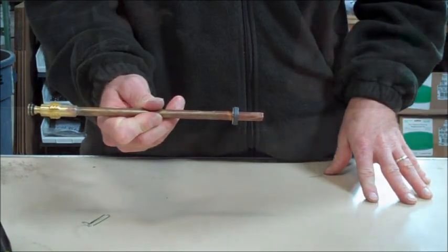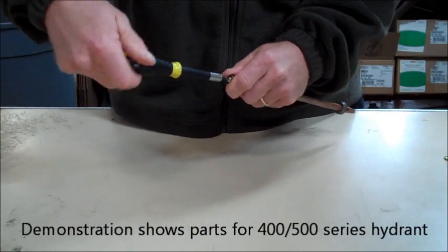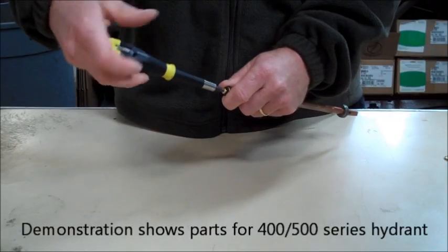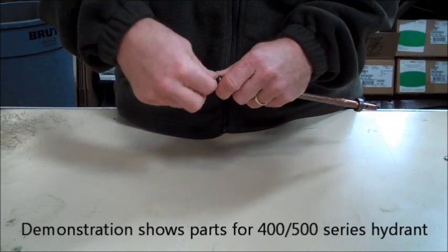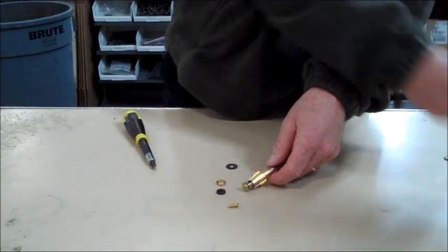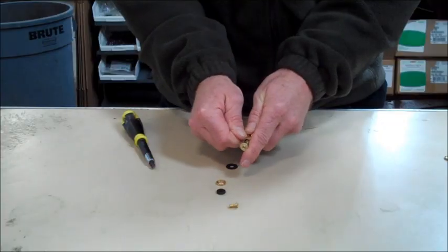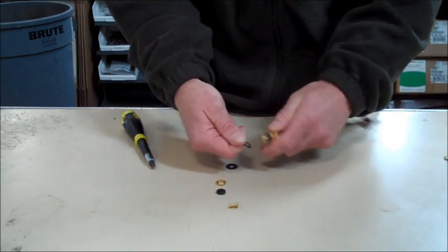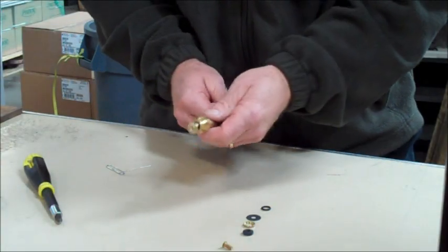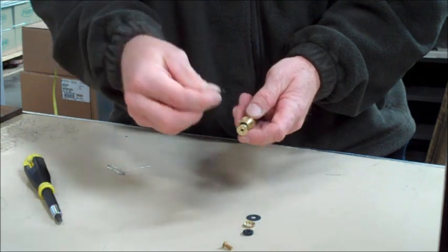Prier recommends also replacing the remaining parts on your stem when you are servicing this hydrant. Begin by removing the bib screw and any washers. If you have a small o-ring on the stem end of your hydrant, you should remove this as well. This can be maneuvered easily with a small piece of wire or even a paper clip. Next, find the new parts in the repair kit that match your old parts and begin assembling the stem end with these new parts.